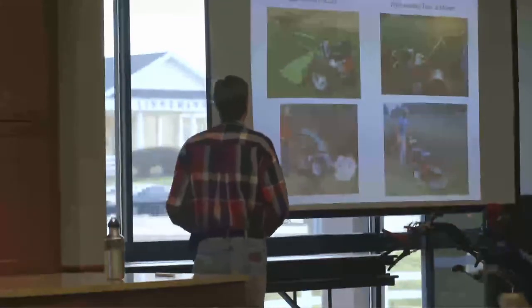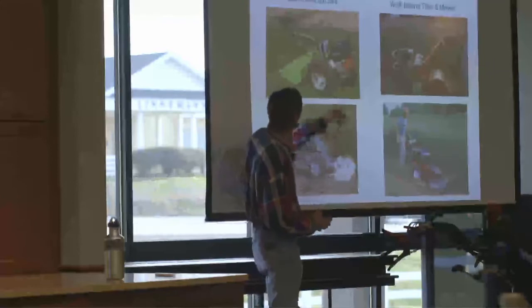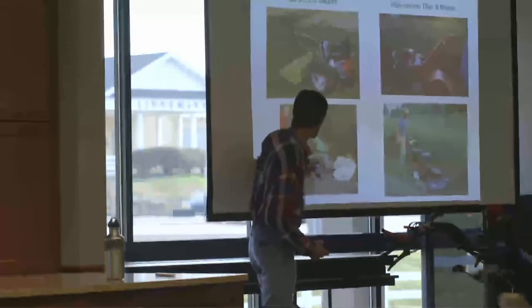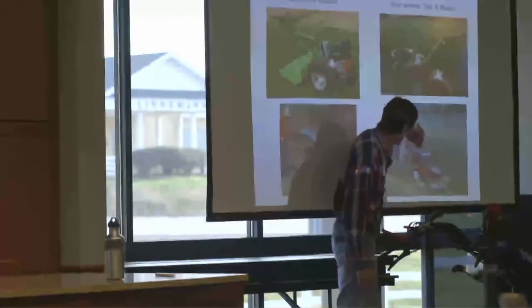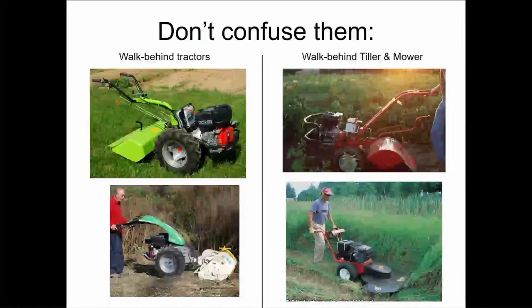One thing that characterizes at least modern walk-behind tractors and really sets them apart is just the drivetrain system. You notice these drivetrains, like the engine powertrain, go straight through this machine. Same with this. This is an all-gear drive machine. This is a powertrain going downward here and then being shifted here to the front, that's a belt. This has a powertrain that comes through, goes down to the transmission, that's a belt right there.